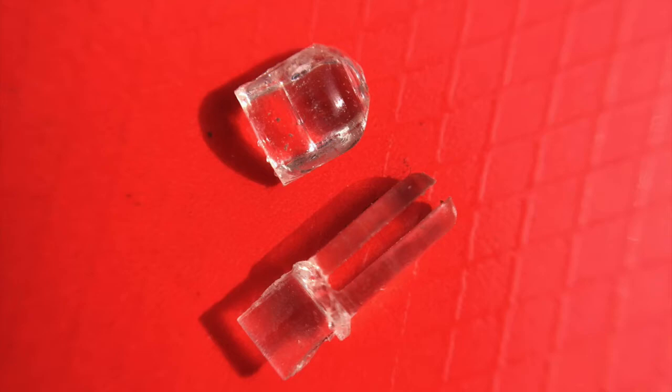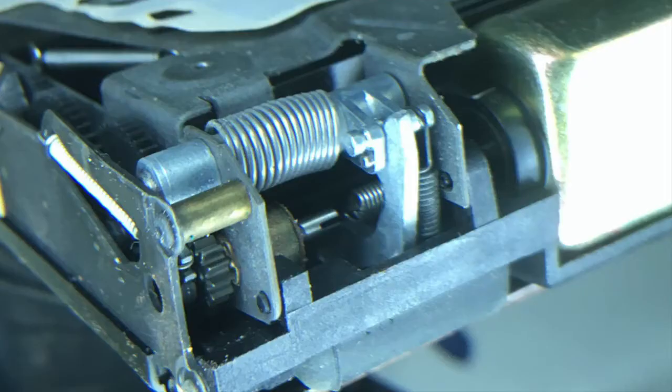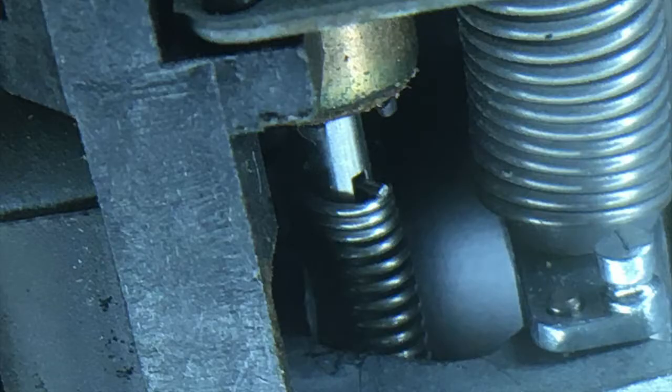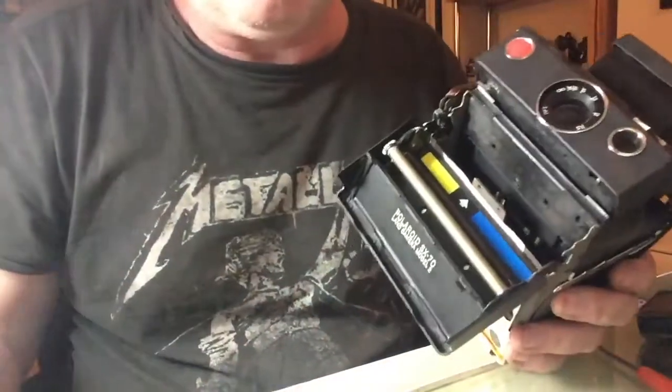This is the broken plastic drive — it fails on most SX-70s. So I need to hook up that shaft with that spring. The next two photographs show that I've actually stretched the spring so that it fits over the shaft, and the hook on the spring fits into the slot on the shaft. Got that — back off.